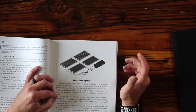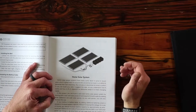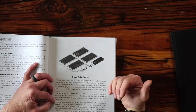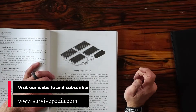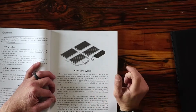In this project, you'll build a 400-watt home solar power system by starting with a 100-watt solar power kit and expanding it to 400 watts by adding three additional 100-watt solar panels. As you add panels, you'll also increase the size of your battery bank by adding additional batteries wired in parallel to increase battery capacity without increasing the voltage. As a rule of thumb, you should increase battery capacity by approximately 35 amp hours per additional 100 watts of solar panel that you add.